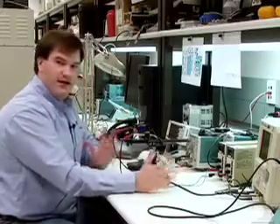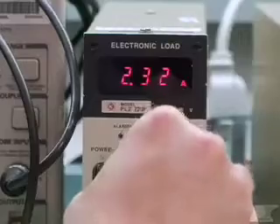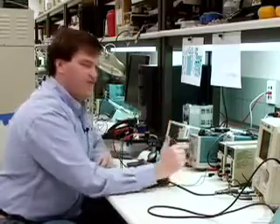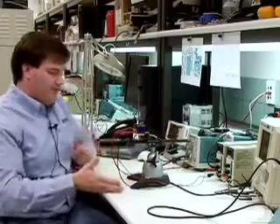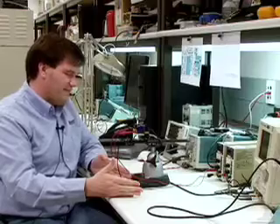At 85 volts in — the lowest AC input voltage for this circuit — we're getting 5 volts out. I feel comfortable loading this circuit to full load, so I'm going to load it to 4 amps. Now the power supply is operating at full load. The voltage spec is 5 volts plus or minus 5%, meaning we're allowed to range between 4.75 volts and 5.25 volts. But we're reading 4.61 volts on the e-load, which is a problem — if the power supply can't stay within specified limits at full load, it's not a very good design.